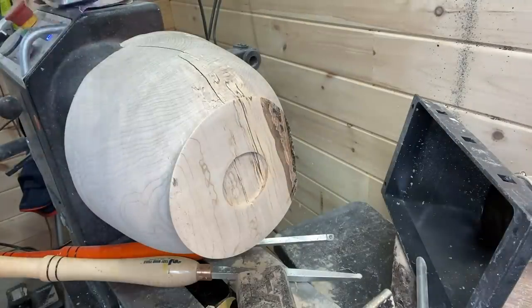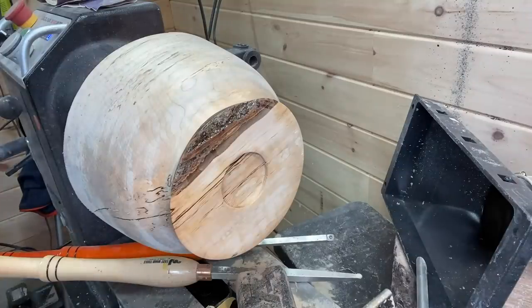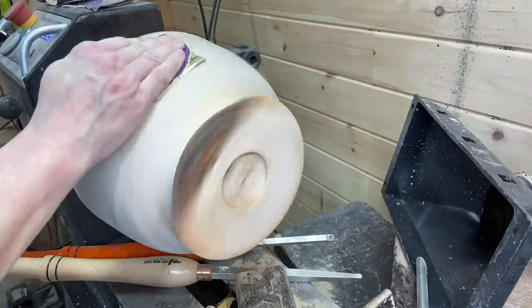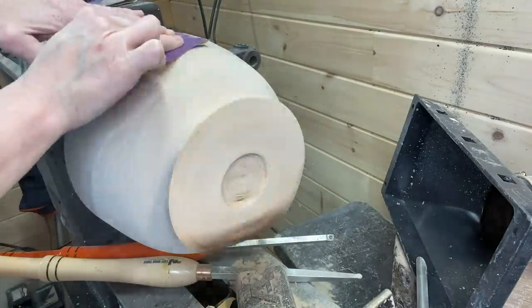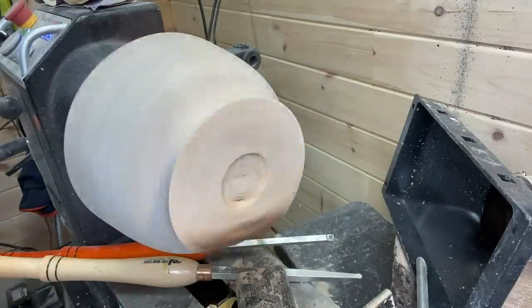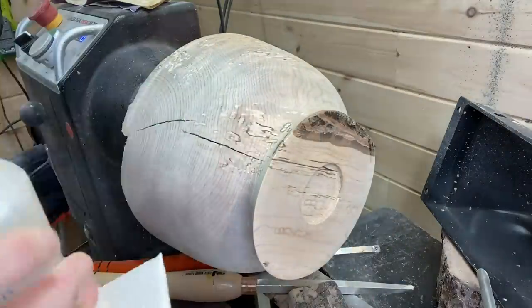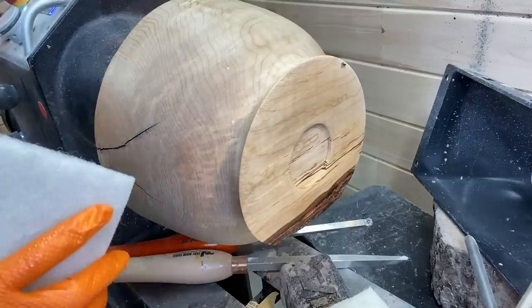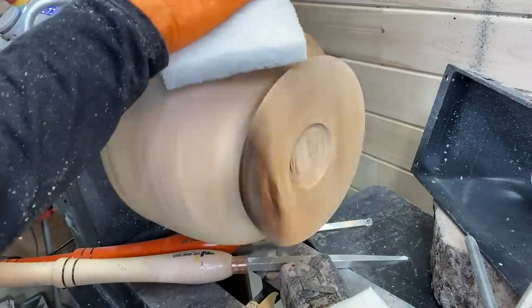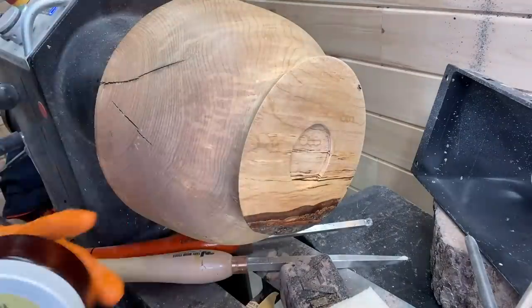So after that's cleaned up and a little bit of sanding, which I did not film, using some denatured alcohol here to clean the surface, and re-sanding with 220, which is where I stopped before the denatured alcohol. Re-sand with 220, and then I will go up to 320 and then apply sealer. Then the abrasive paste and polishing paste from Axe.